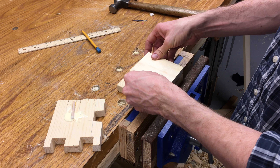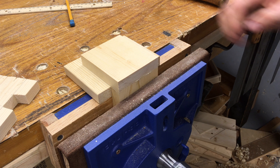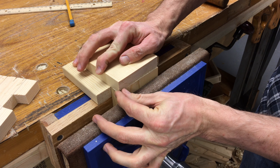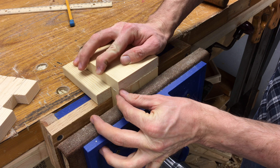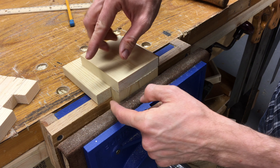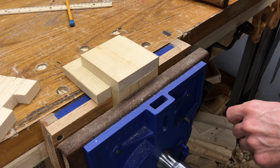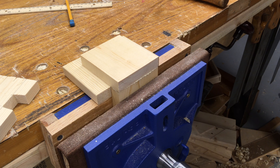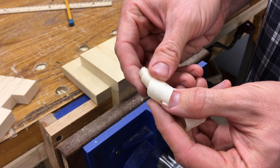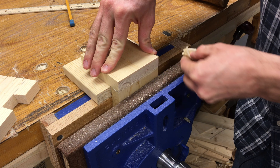Now that we've got the glue applied on both pieces, I'm going to put this back up to give me some stability and place this down. Just slide it on there to spread the glue around a little bit, then match everything up. Before you start, you want to make sure all your pieces are the same width and squared off. After that, wipe any excess glue — I'll use shavings from my plane to wipe off the excess.